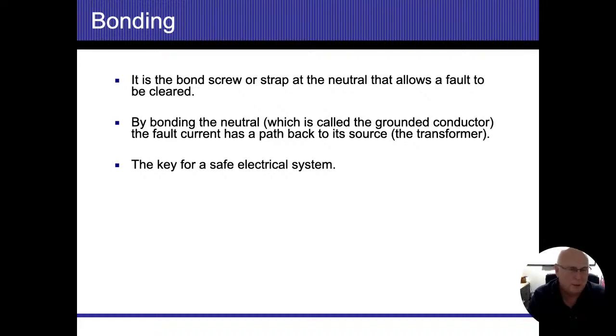In Chicago, we have something called a Chicago ground, and they did that in a lot of the suburbs around here as well. So they'll come out of the electrical box, usually at the first means of disconnect, and they'll go to the closest water pipe. When they get to the closest water pipe, that's where they're going to attach their grounding electrode conductor to that water pipe. From there, I need to follow that water pipe until I leave the building. If I have any sort of dielectric unions, or I'm switching to plastic pipes or something like that, I lost my grounding connection. So I have to have jumpers over those if need be.